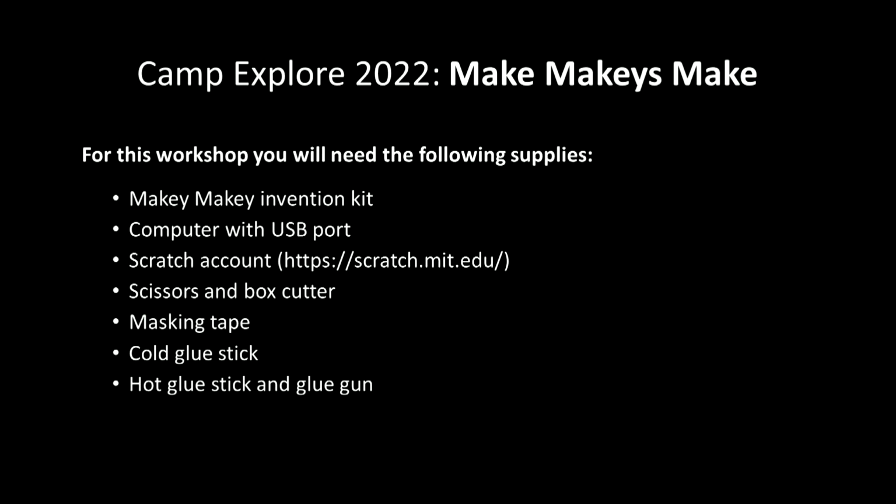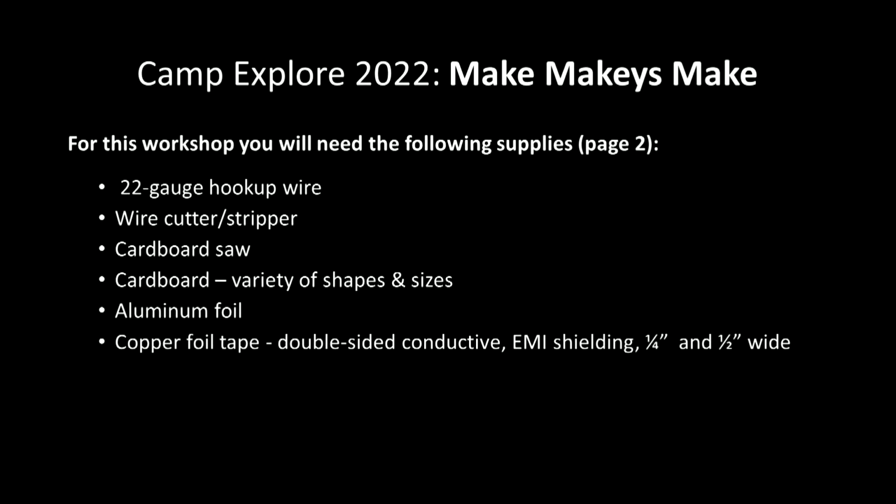Now, the one thing about copper tape is it is made of metal, and it's very thin. What else is made of metal and very thin? Knives, yeah. So after long workshops, the tips of my fingers will often look like I have paper cuts all over them, because that does that. So be careful. The aluminum foil is good for covering big surfaces. If I were making buttons, I'd use the tape. If I were making bigger surfaces, I'd use the aluminum foil. If I were making cool things like stars or the outline of a cat, I might cut it out of the aluminum foil and use a glue stick.